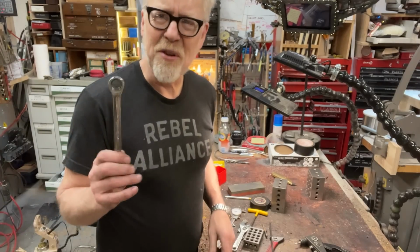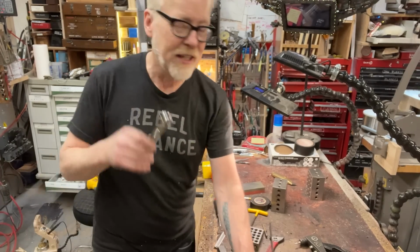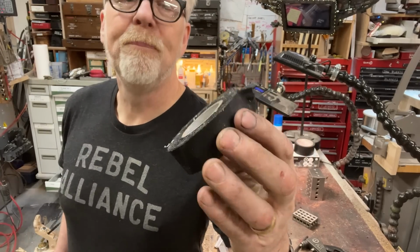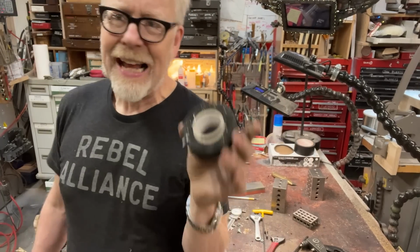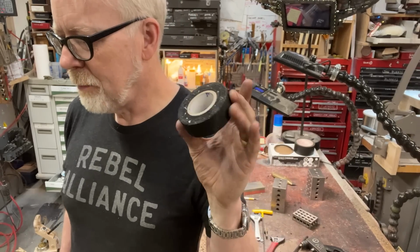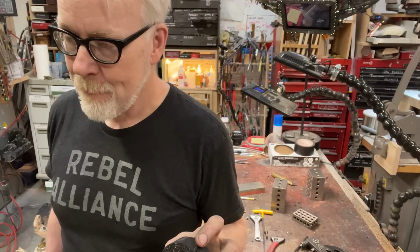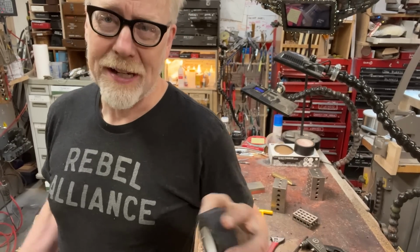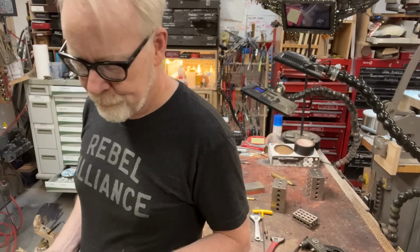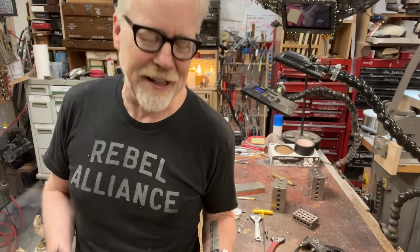That was used to tighten down the motor where no other tool was able to get in that little shallow space. Cloth electrical tape. I like this stuff. I like it for finish work. Regular electrical tape has a wide variance in quality. And if you grab the wrong roll and you wrap it tight, it can slowly work itself away and get sticky over time. I've cleaned up so many messes of other people's vinyl electrical tape.